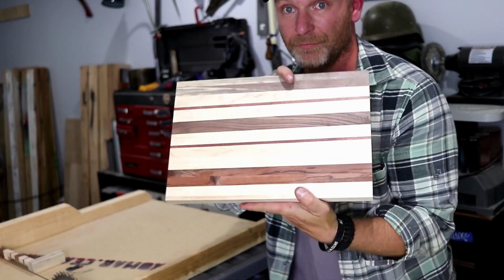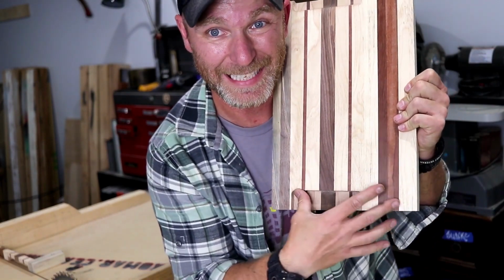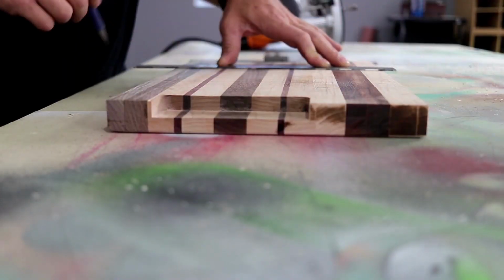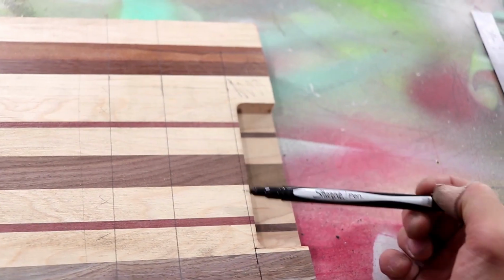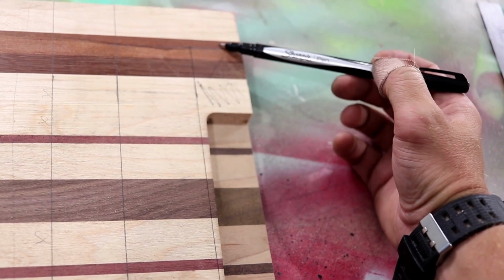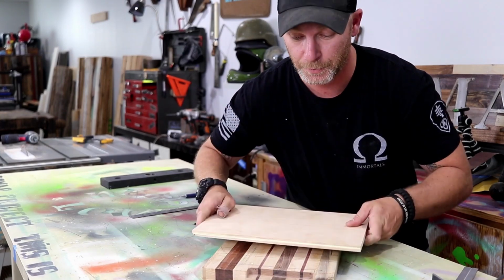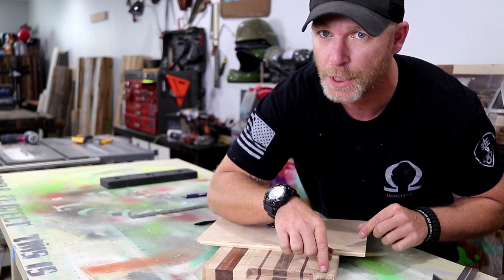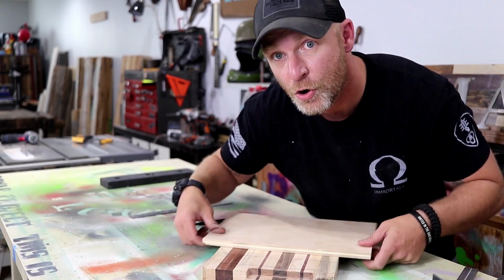We have it all cut out. It's a rectangle. We gotta take care of the back end, and we need to make these even. Even? Okay, in order to make this even, what we're gonna be doing is extending this handhold to here. All right, and to router out our handhold here, scrap piece of wood, I'm gonna place it on here, and our router is gonna ride right alongside of it. Just make sure it's not doing the gangster lean when it's riding. Straight.